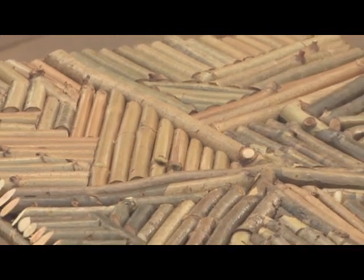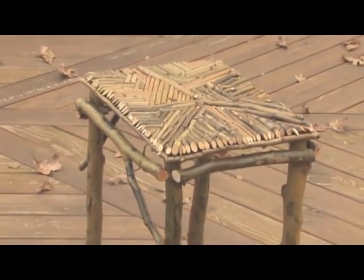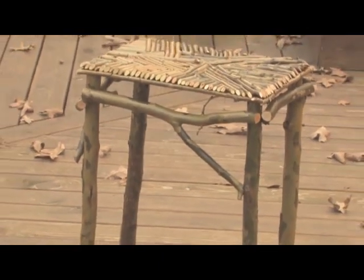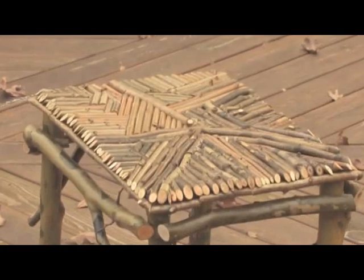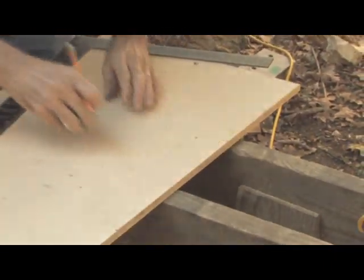This small table made with fresh-cut sycamore twigs and branches would be perfect in an entry hall — a place to put a hat, purse, or keys — and is made from materials harvested straight from the forest. One-and-a-half-inch-thick stock cut from saplings forms the legs, and a piece of half-inch plywood provides the foundation for a rich textured random mosaic on top. While this table is made of sycamore, other woods would work as well or even better — willow, for example, has straight flexible branches that would be easier to arrange in a more uniform pattern. I like the way the twigs looked when cut at an angle on the ends, and I arranged them so that the ends formed a consistent pattern around the perimeter of the top.